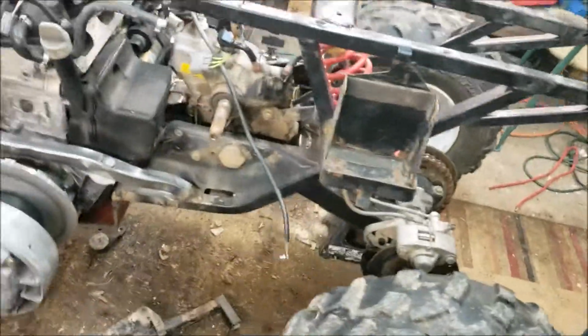Alright, well, we've got all the motor mounts put on the motor. I'm going to take the 2 shaft pieces and the belt with me to work so I can machine and get them to fit together nicely. And then I've also got to take the belt with me so if I get off work on time I can run it down by Dunham Rubber and have them look at it and see if they can do something with it or build us the right belt, and we should be golden. So here it is, guys.